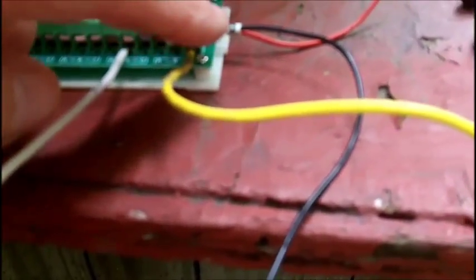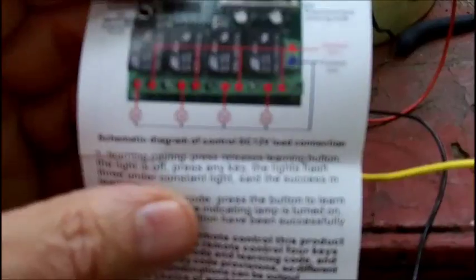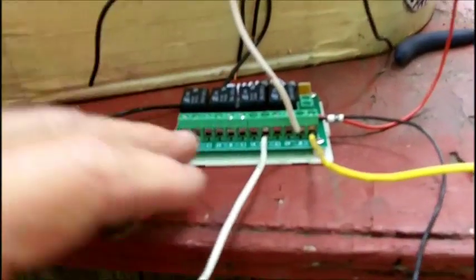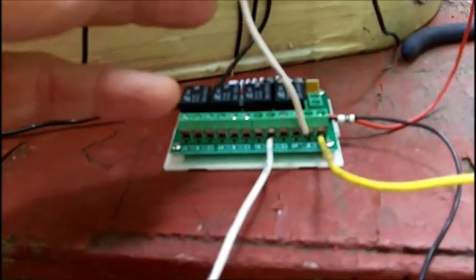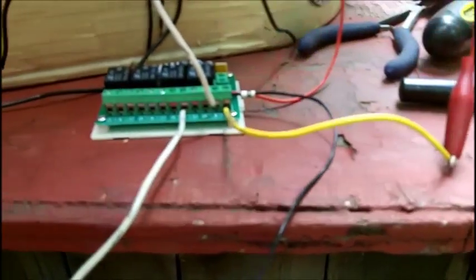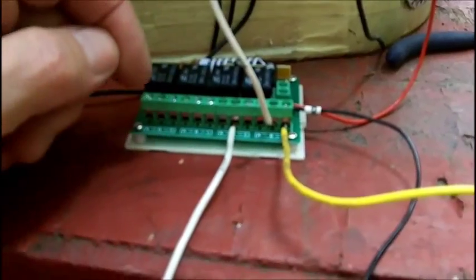That's strange. I think what I'm going to do is to stop this nonsense of going to C, even though the schematic showed that. I'm sorry, I can't get you in camera here. The schematic shows that C is supposed to be a positive. It can't be. I'm just going to use this as a switch, and this will be switched to 12 volts, which means there'll be two wires coming out like there was before when I demonstrated it. So one of the leads will be connected to B plus, or in other words, positive here. In other words, we won't use C. And the other one will be connected to the relay, and then at that time this will work properly, because this is not working right.